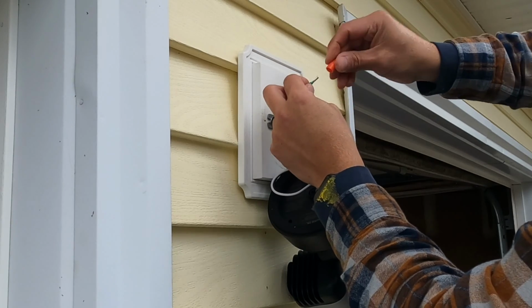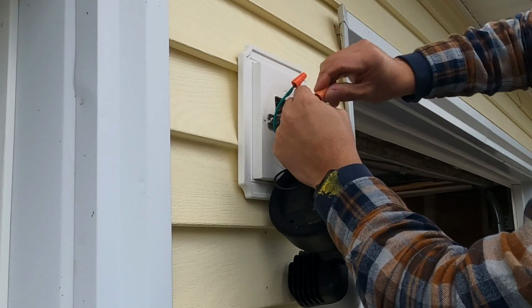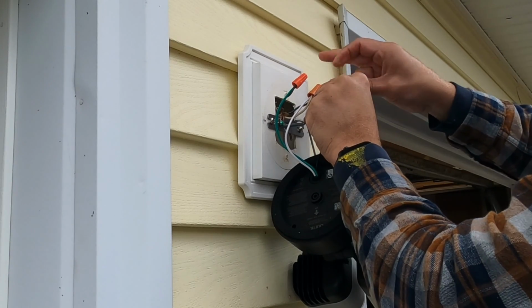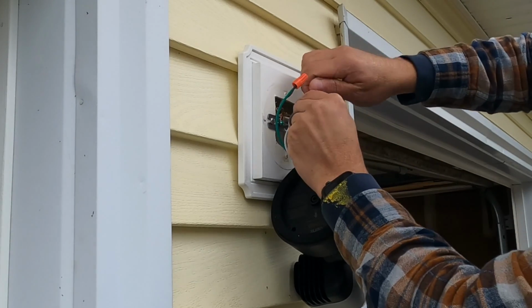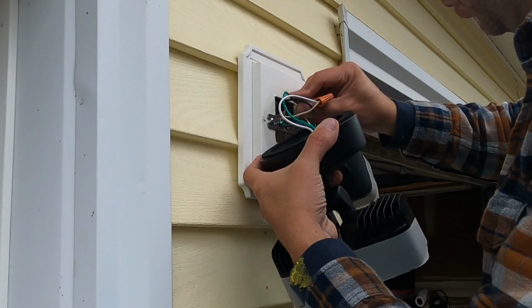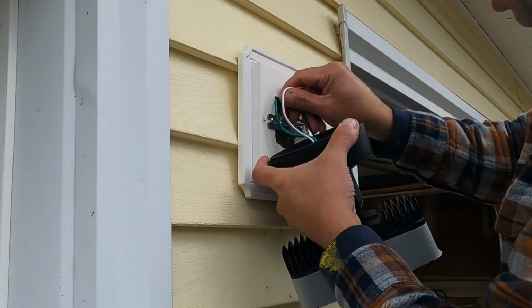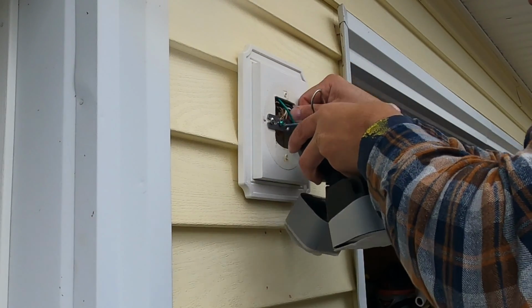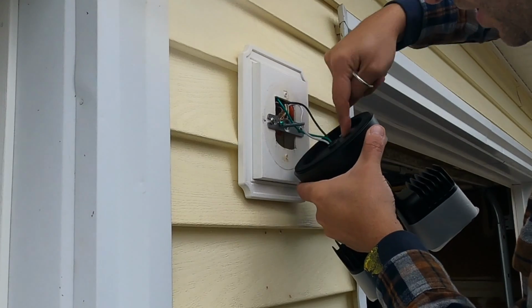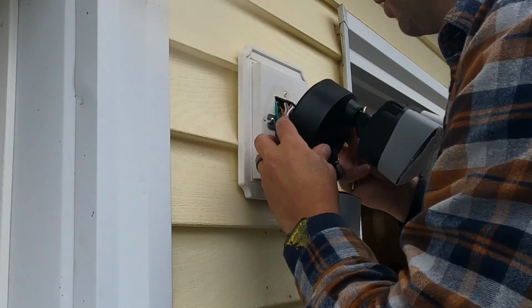We're just going to connect our ground. All right, we'll get our neutral connected now, and we'll get our hot connected. You want to make sure these connections are done up really tight, right? You don't want any arcing wires because that's what causes fires. We need to tuck our solid wires back into this mounting block, and then we can take this S-hook off. And there should be enough room in this back cavity here where these stranded wires aren't going to interfere with anything.